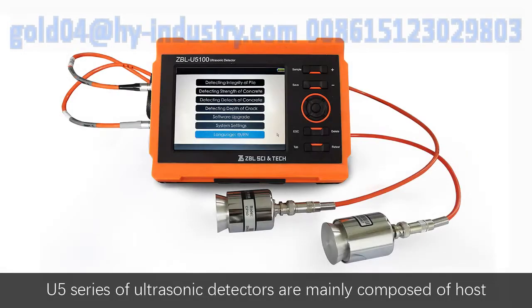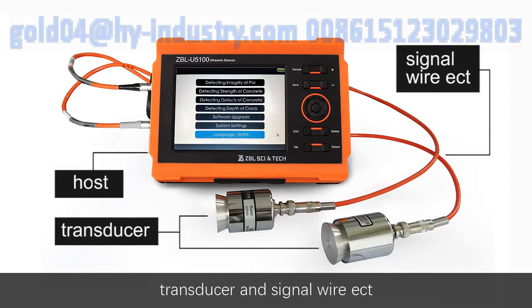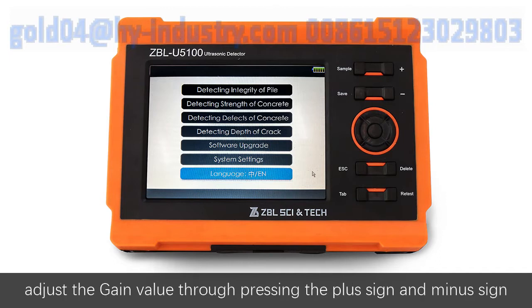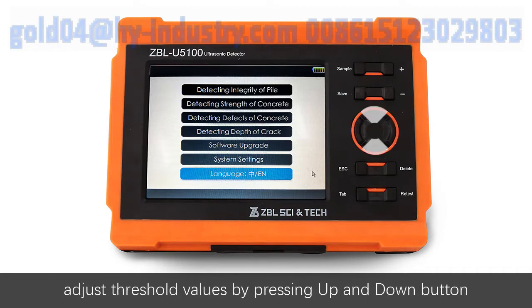U-series ultrasonic detectors are mainly composed of a host, transducer, and signal wire, etc. You can operate the host through the LCD touchscreen and keyboard on the right side. Adjust the gain value by pressing the plus sign and the minus sign, move the waveform position by pressing the left and right keys, and adjust threshold values by pressing the up and down buttons.